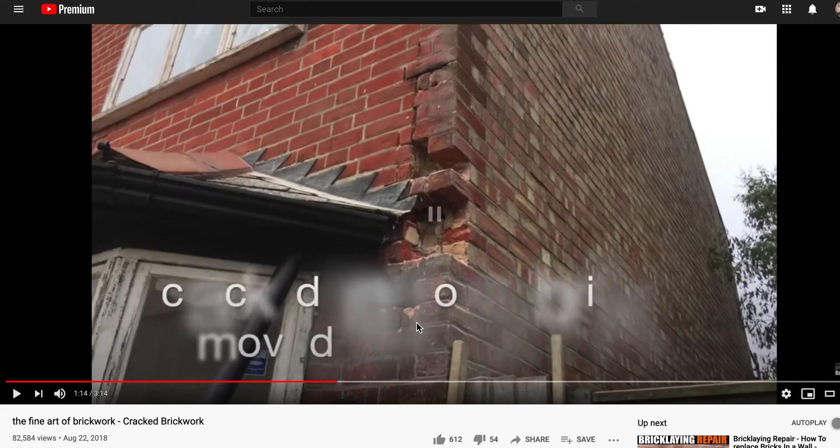Because you've got such small columns. This would be a column — the entire front of the house. You've got a header. Again, we've got that one little window action going on here. Look at the thumbnail — it catches right here. Follow my mouse. You see there's a column in the middle, a column to the left, and a column to the right. Then there's that window. You've got a huge plane with just these columns — four columns for that great width. It doesn't take much to undermine it.